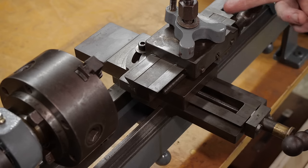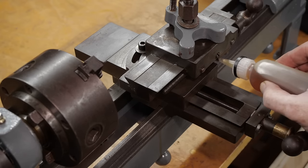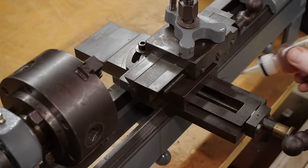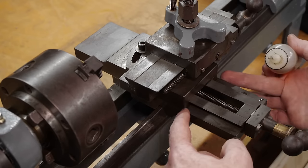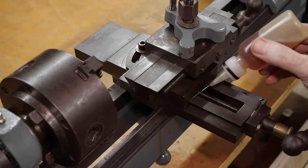This top slide has the sliding surface on the top of the dovetail, which is slightly unusual. It also has a lower sliding surface on the back, but not on the front. The lead screw is obviously very important to oil, but very difficult to get to. The cross slide looks more conventional in that it has two lower sliding surfaces on the bottom of the dovetail, but the top surfaces also look like they're in contact — which I've never seen before — but I'm going to oil them anyway.